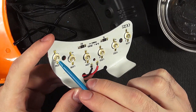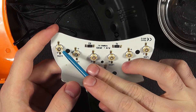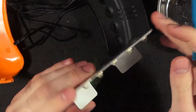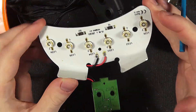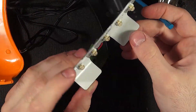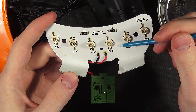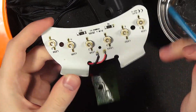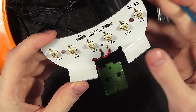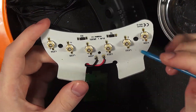We've got what looks like 3-watt style — 1 to 3 watt probably — LEDs, and they're on an aluminum backed PCB. So this is just a large unit that they then bent down; you can even see the stress on the upper layer here from the bend. Doesn't matter — there's no tracks, you have no worry. And here are our two leads heading over.